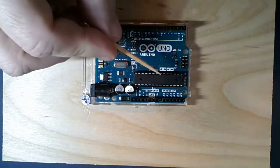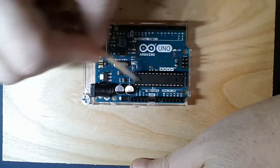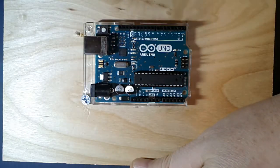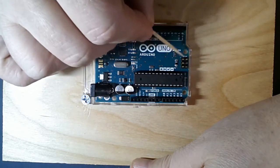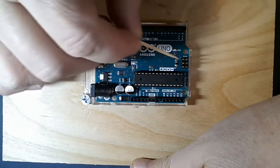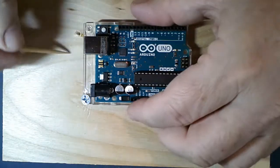The main component on the board is this microcontroller chip. It's called a DIP - dual inline package - because there are two rows of pins on either side. These other connectors are called SIPs - straight or single inline package. We use DIPs more for integrated circuits than actual connectors.